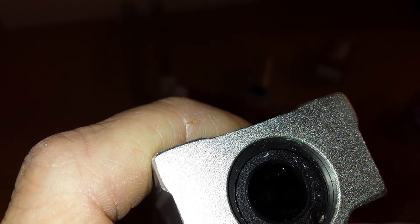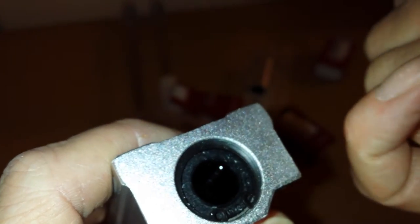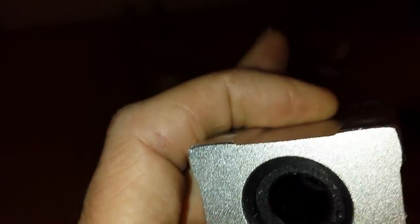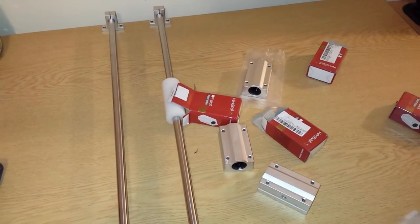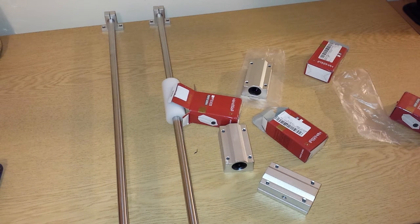That is small pieces of aluminium with the grease. So if it's on there, it's in there. If it's in there, those little tiny ball bearings will only munch it up and put even more score lines than already exist on these beautiful shafts. Or not so beautiful. Yeah, you have to take it with a pinch of salt, of course, buying anything off of eBay and from China. And with a budget in mind, you get what you pay for.